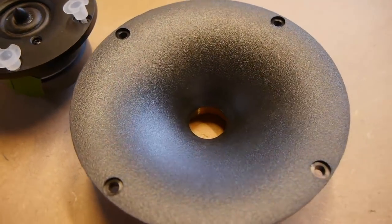It's been around a long time so there's lots of information out there about it. Second and third place are so similar, but I give the edge to the SB 29 if your budget can afford a little extra — it's slightly larger in diameter so it can handle a lower crossover point. I've abused this tweeter and it's never failed me, so if you need high power handling, low crossover, all in a small package at a great price, it's really hard to beat.